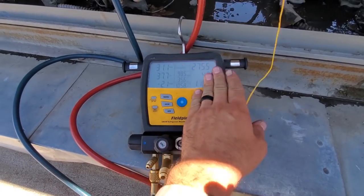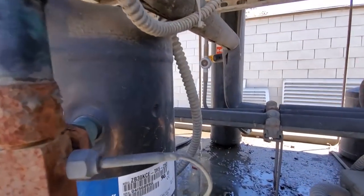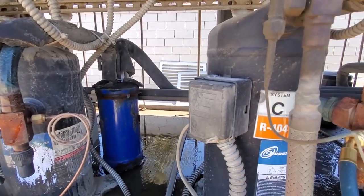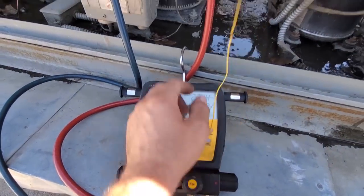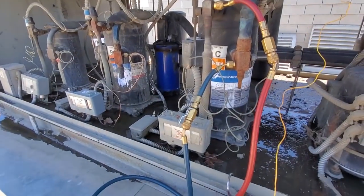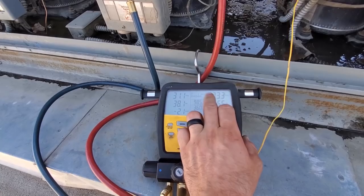So we tried to pump it down at the temperature controller — it just satisfied the temp control. And that sound is the inside of the compressor bypassing. You can see — it's running, it's still got a cold suction line and a hot discharge line. But it's just internally bypassing and you can hear it. And what it does is when it hits about 410 PSI, that's when it does that.